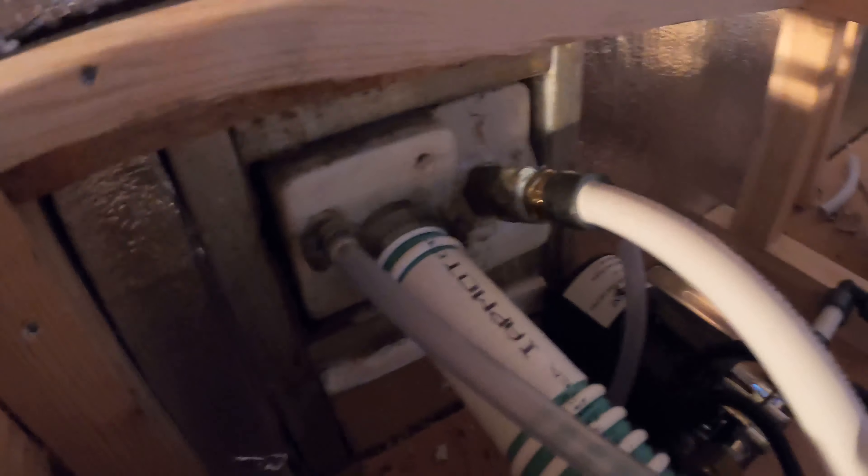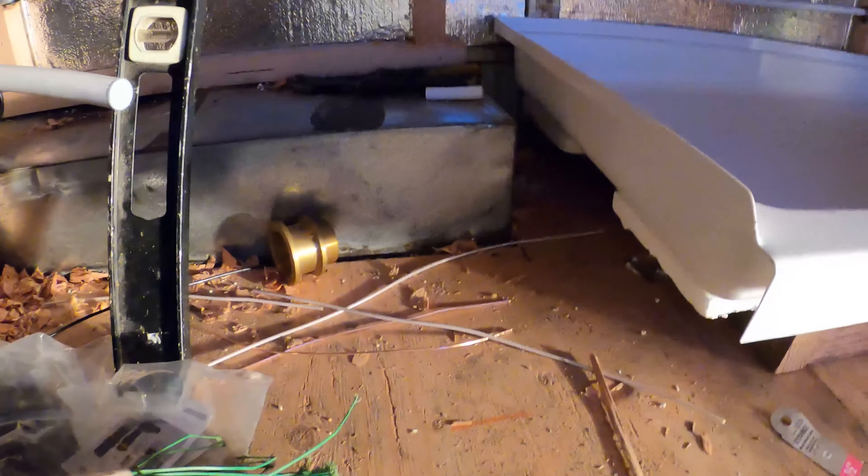One of the frames is done, now I gotta do a frame for the plumbing. Framed out this box here and then frame out this wheel well, so I got the whole water thing framed out — took a little adjusting because it's a different height and I have to let it pass through. I still have to do the other wheel well but there's some plumbing stuff I need to figure out with Dan first. Last thing I'm doing today is putting the second layer of insulation wherever I can, except where the lights are until David finishes those areas.